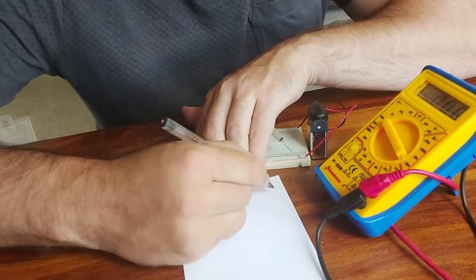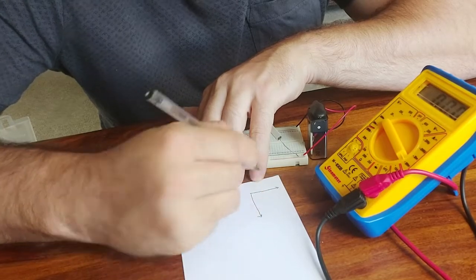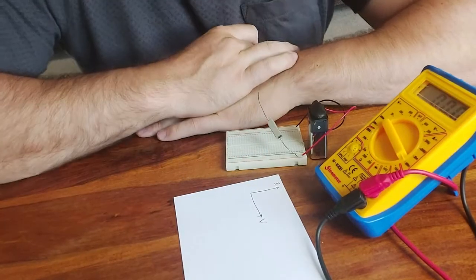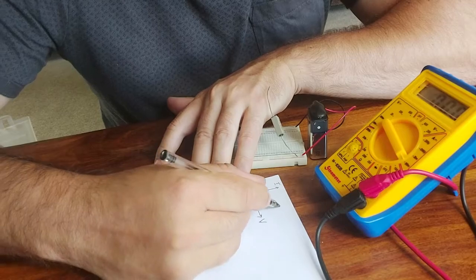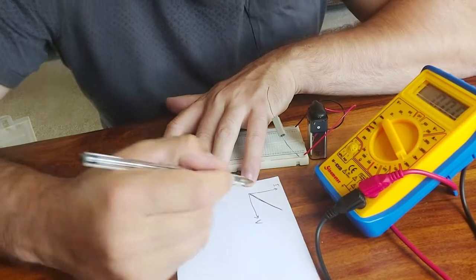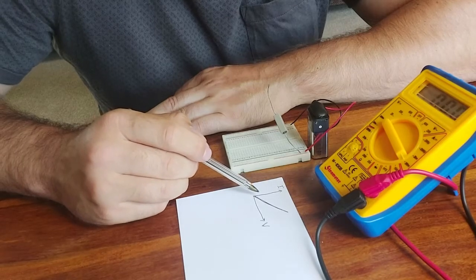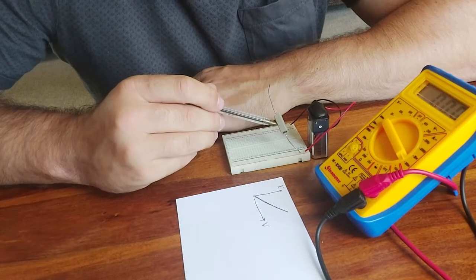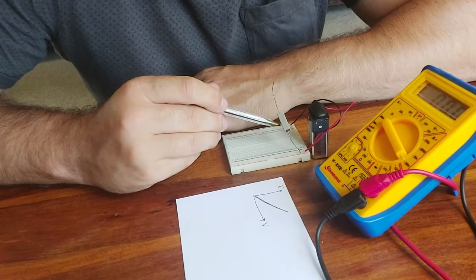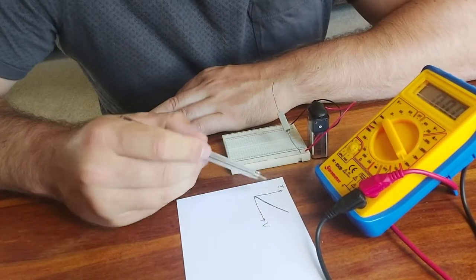So that formula we just used, Ohm's law, can be plotted on a graph, a current voltage graph. As so. That is supposed to be a straight line. So Ohm's law says that provided our resistor or our component which is obeying Ohm's law, providing its resistance stays constant, which would usually mean that its temperature must remain constant, then the current is directly proportional to the voltage. If I was to double the voltage over my resistor, I should also double the current.